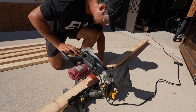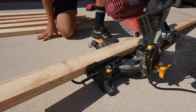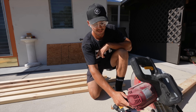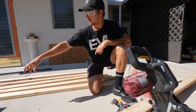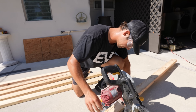So he's got it all measured out. What's your actual length right here you're cutting these? These are eight-foot pieces — we're cutting them down to six feet. We're actually going to use the extra pieces as supports, as pretty much the ends. Once we cut all our bases, which is four pieces, we'll have all these extra ends to build our two frames. Then we're going to cut our four-by-four up to two feet, and that's going to be our structure — that's what's going to bring it up to two feet.